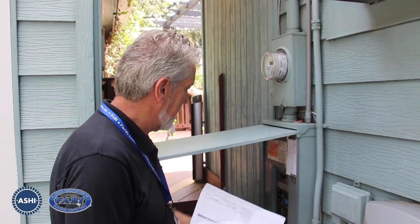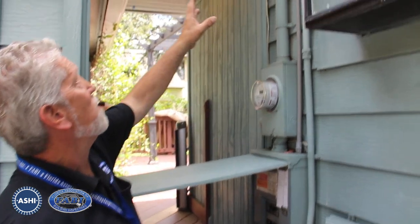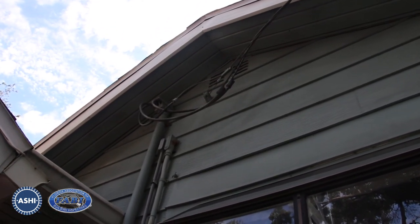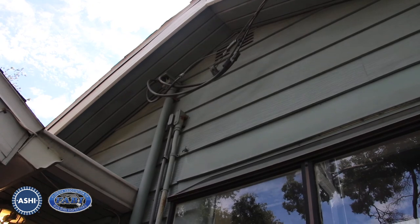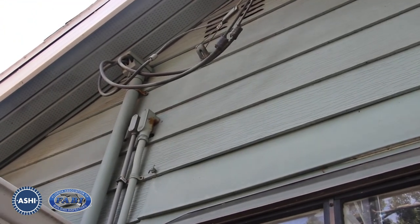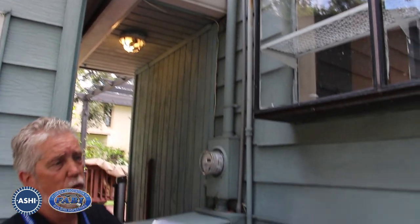You actually have to sit down or kneel down on the steps to get access. We're going to look up the riser and look at the attachment points for the overhead service. The attachments are in pretty decent shape. The two that are taped off are the hot wires coming in from the street — the overhead line it's attached to. They're okay; they could be re-taped. An electrician can come in, clean them up and re-insulate them so that if they get touched during a storm, they don't short out and cause a failure.